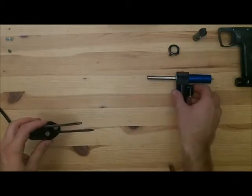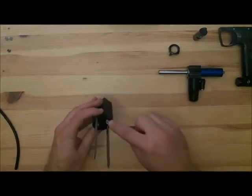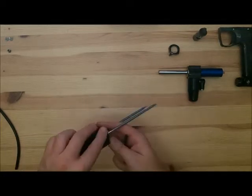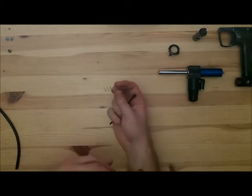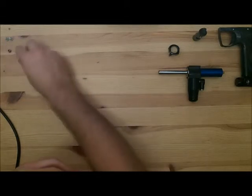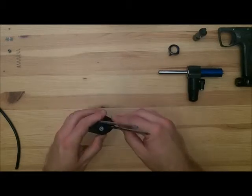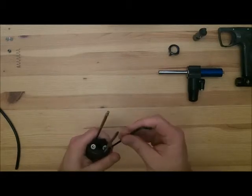Okay? Now we're going to set the valve aside for just a second. There are two 1/8 inch screws here in case you really want it to clean. That's the return spring that I just dumped out. I think it's set over here. Make sure you keep that separate. That's a standard return spring, but it's been clipped by rod from the factory to be proper.